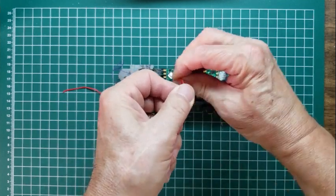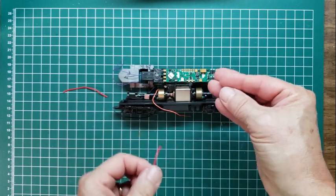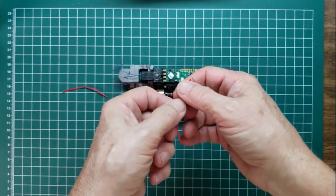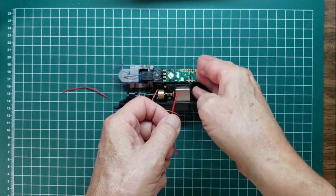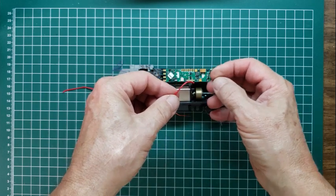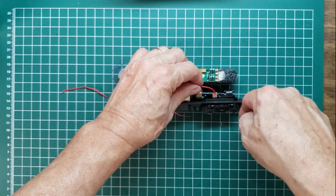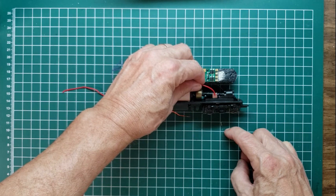We're going to put the red wires in vertically and solder them along the sides. The objective is that when the wire is like this and the truck is moving back and forth, you get torsion. Think of it as a group of stranded wires — never use solid wire because solid wire will do this about 10 times and break. Stranded wire will eventually break too but not in your lifetime. By putting it on the side at an angle, straight down, you get torsion forces on that joint, which is very important.